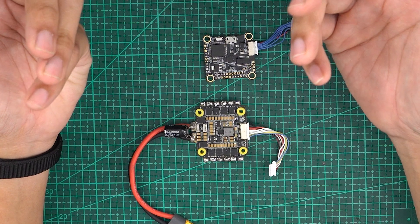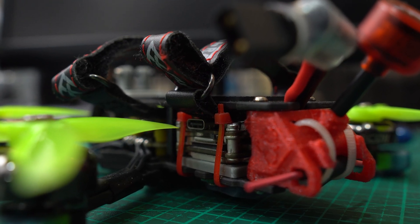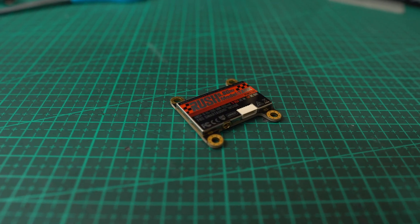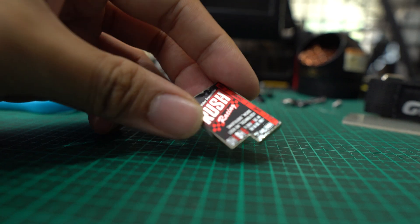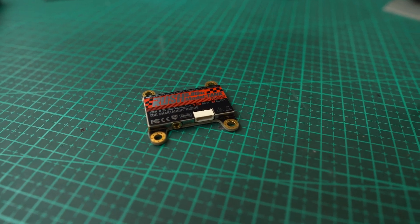These two components — ESC and flight controller — are the most important of the quadcopter. If the ESC is compromised while the flight controller is okay, you could consider dumping the ESC and buying a new one, but make sure the JST pins on both sides match the pad labeling. I've mixed plenty of brands of ESC versus flight controller with no problem. As for the air unit — it's built like a tank. It can take water and come out like a champ; DJI has done witchcraft to their electrical components. All four times I went underwater, the air unit survived without compromise.